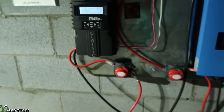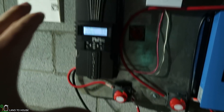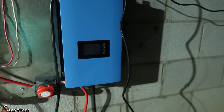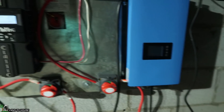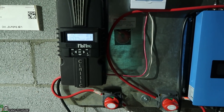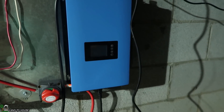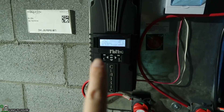If you want to check out that kilowatt meter I've got a link to the Amazon page down below. Let me make this point clear again: the charge controller brings the power from the turbine and feeds the batteries — that is basically a separate circuit. That happens no matter what the inverter is doing. So when the inverter does not see the voltage that it needs — let's say it drops below 60 or 62, whatever I've got it set on — it will turn off. And then as soon as it sees the full charge of 72, it turns back on. No matter what the charge controller is doing with the batteries, the inverter is a separate device. I hope you enjoyed that little bonus content. I'll see you in the next video. Bye.